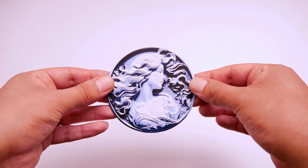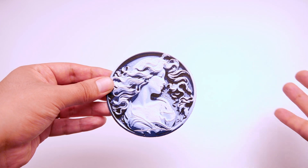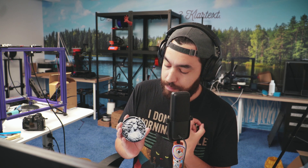Here's an example of the HueForge tool. We have a black, blue, a lighter blue, and a white filament. You can see there's a beautiful gradient with the contours between the white and the blue. The first layers are quite dark because a lot of the dark blue is shining through, but as it builds up it becomes lighter until it gets to the lighter blue, and then those layers build up until they go to the white. It has a beautiful contour look to it. I can't wait to try this on something like ABS or PVB filament, which can be dissolved in alcohol — or with ABS, it's acetone — to really get this blend going. We're going to be playing with this for a while. First we have to get all the colours of our Eco PLA filament put onto the library of the program, since different filaments have a different amount of translucency. Stay tuned, we're going to be doing a follow-up video next week or the week after.